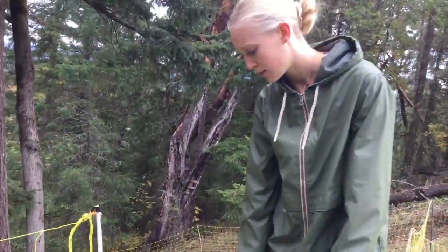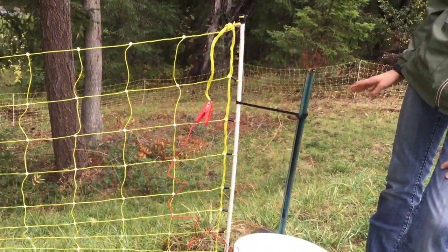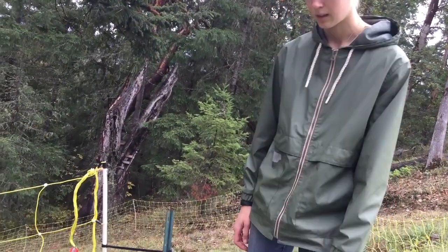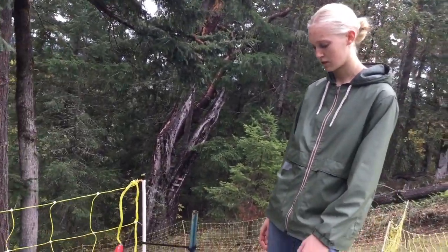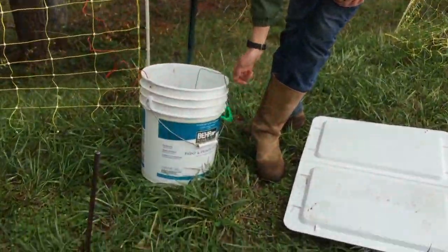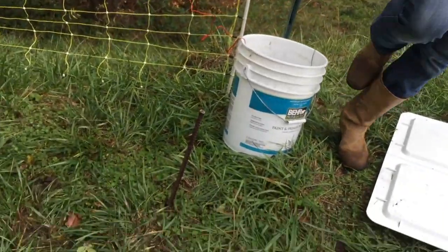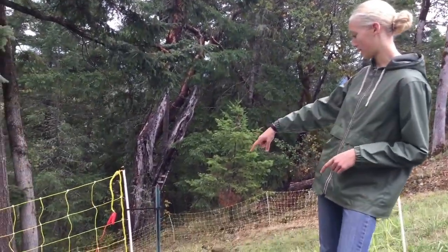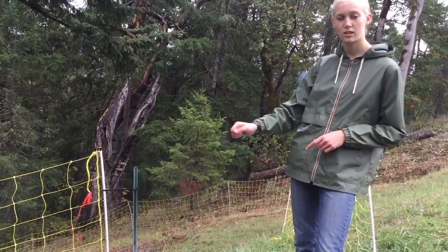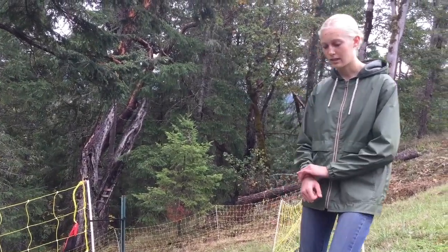So here's what I have in the box. I have my red clip clipped to the fence right here. I really hope I'm doing all this right because I don't want to short circuit anything or ruin this, but I read through the instructions and I'm doing what it shows. Then this green clip - once we plug in the green clip and have the goats in here, the green clip is going to clip to our fence grounding rod. I'm going to plug in the green clip and use our voltage tester to make sure the voltage is correct and that everything is functioning.